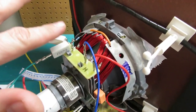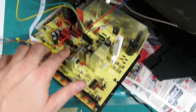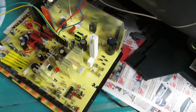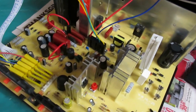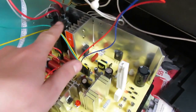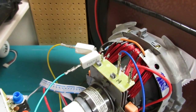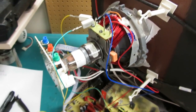Checking around: the resistors are really cold, all the heat sinks are cold... but this guy is hot! It's a 25-watt resistor and it's still that hot — that is ridiculous. Must be the power supply section. I'm going to remove one of those resistors now and see if we get the screen to come up a little bit larger, and then the last step will be to remove both and see if we blow this thing.